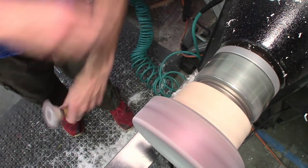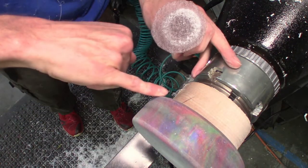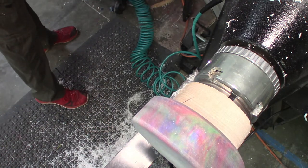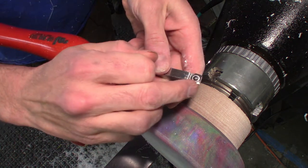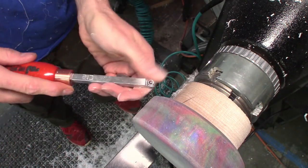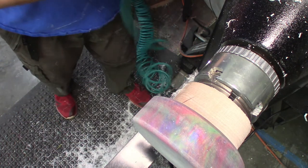Nice. All right. So that illustrates the difference, because I was using a regular cutter. I like the regular cutters to come in and get a very square edge. The negative rakes are radiused, just a little bit of radius, like a two degree or something, whatever. But I can sit here and play with this and I'm not going to get a catch like that with a negative rake cutter, like at all.